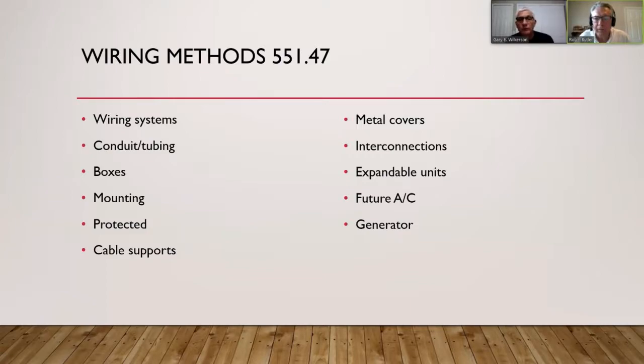If the box does not have a cable holder, your staple must be within 12 inches of that box. It must be a UL-listed fastening device — you can't just take a nail and bend it over; that's not approved. Inspectors look for proper fasteners. If an inspector rejects a nail, you'll have to redo work you already did. Buy the correct staples from the start — they come in boxes of 50 to 100 and are not expensive.